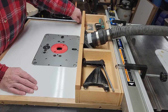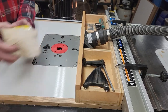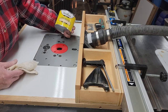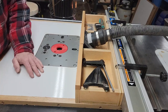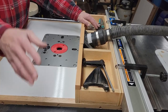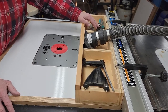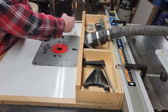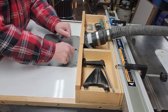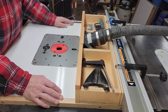It's highly waxed. I use this Varathane paste finishing wax, and everything is waxed with that — my sled, the router table fence, my outfeed table, everything is highly waxed with that. It makes everything slide nicely. Obviously there was no need to put an additional piece on here, so I had something white to mark on — simple as a piece of masking tape.